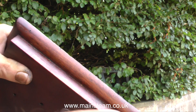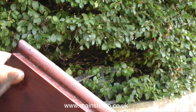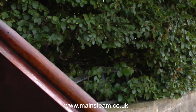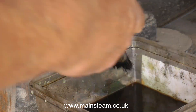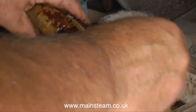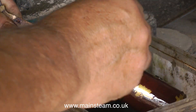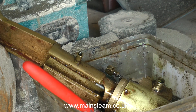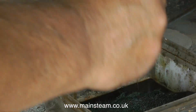As you can see, I'm also using the edge of the ruler to get right into the corners. I'd like to see all of the old French polish removed from this part, and I'll probably give it a light coating of a modern polyurethane varnish using a cloth. With the little bit of cellulose thinners that's left, I'll get the thick of the paint off at least one side of the metal parts. I can see that this engine's been steamed, because it was considerably more difficult to get the paint off from around the cylinder area, which must have been warm at some stage and baked the paint on.